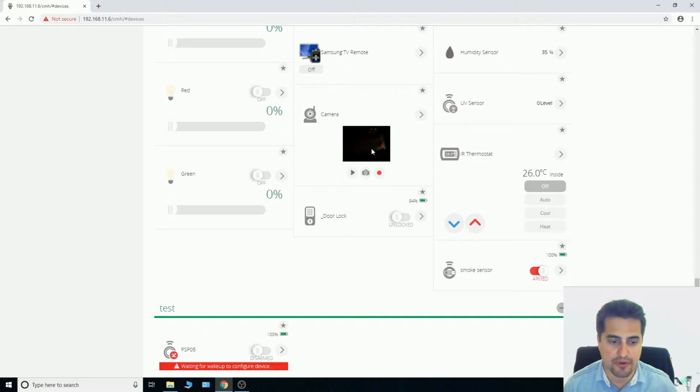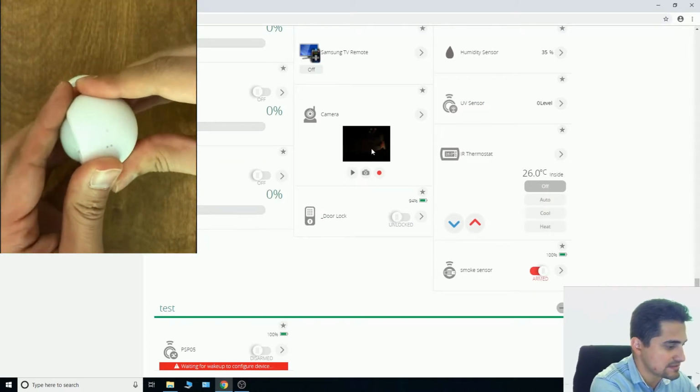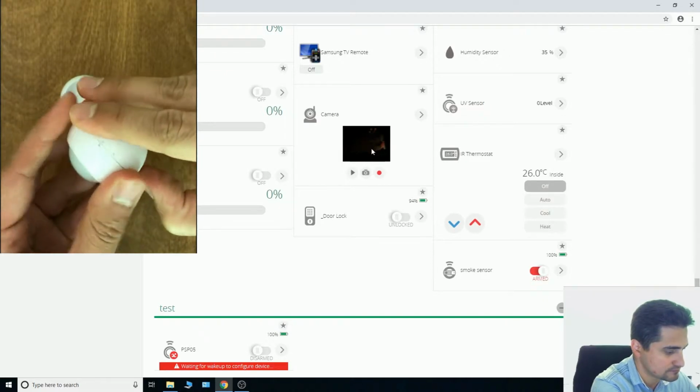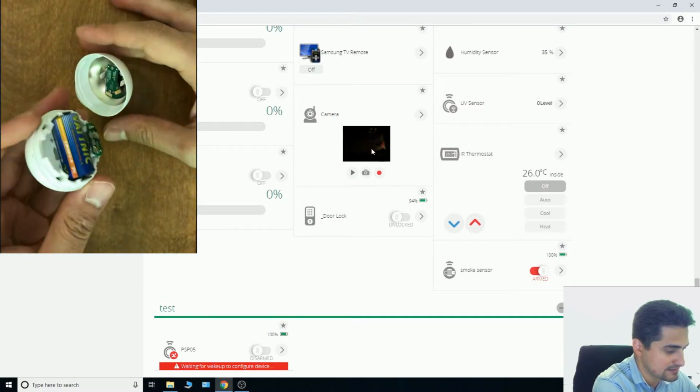This device is battery operated. In order to conserve battery, it goes to a sleep mode. In order to complete setting the parameter, we should either wait for the motion sensor to wake up. By default, it wakes up every 30 minutes. Or we can press its Z-Wave button once and it is woken up for 10 seconds.